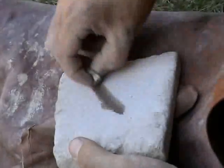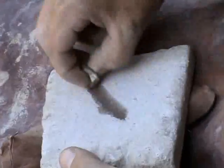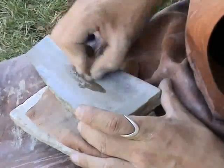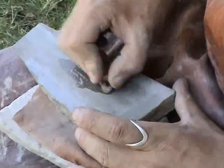To bring the ring into its final shape there are two ways possible: by hammering or by grinding. Of course, these are not mutually exclusive. Here you can see that the ring is roughed on a coarse sandstone. This is followed by finer grindstones, each removing the scratches left by the coarser stone. Needless to say, this is rather laborious work.